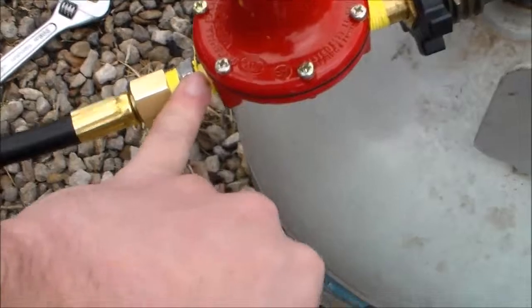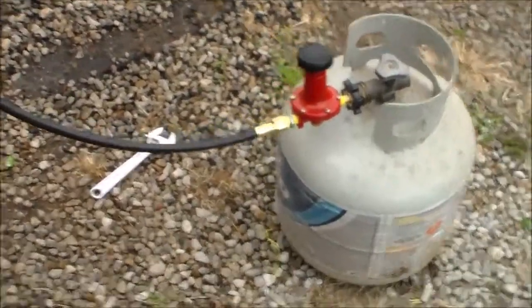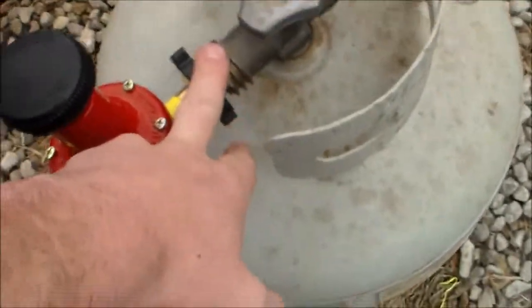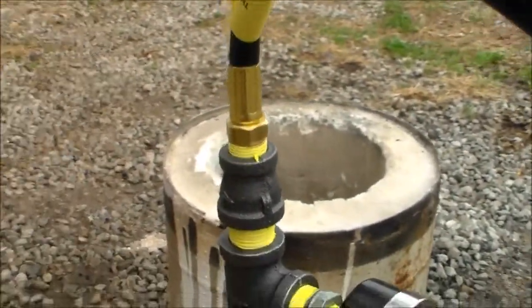We're finished, but I can't fire it up today — the propane tank piece right here is bad, so I've got to go get a new one. That's a trip to Ace Hardware. But here's the full setup: get the tank, the adapter here into your adjustable regulator, then it comes out through the hose and into the pipework. Right here you want your gauge where you can see it, then the shutoff valve — simple. And there's your jet. The rest of the forge, air source would be here. Light it and go.